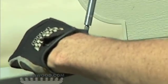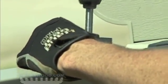The rafters should lay out 24 inches on center, normally starting 12 inches in for the first one. For covers that have a projection greater than 10 feet, use three screws. The first rafter normally starts 12 inches from the side and they are a maximum of 24 inches apart.